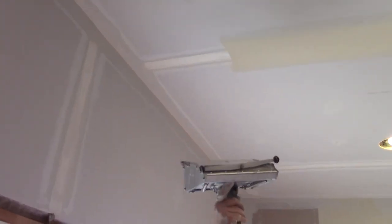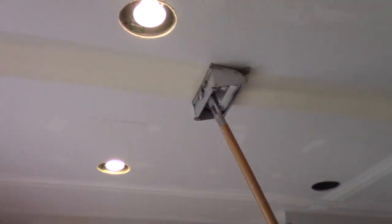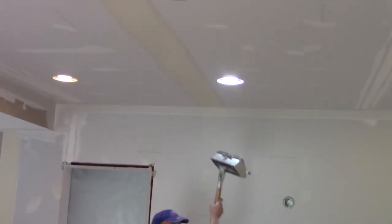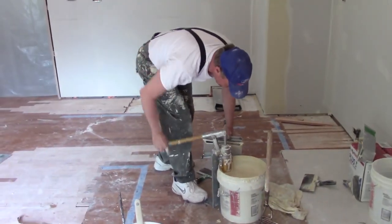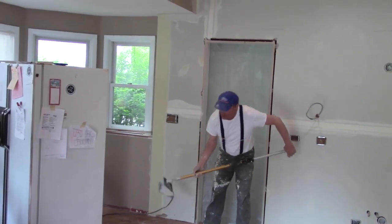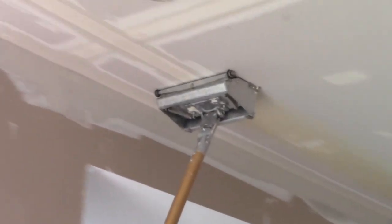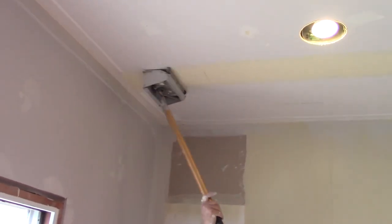So I'm boxing these ceilings now. This is just a small job — only about 9 or 10 54-inch boards and 9 or 10 regular 48-inch boards, 4 by 12s and 4 by 12 by 54. So this is close to 20 sheets, not quite 20 sheets. I did the taping with the bazooka, and I'm going to coat the easy stuff with the box — the ceilings and stuff with the box — and scratch.